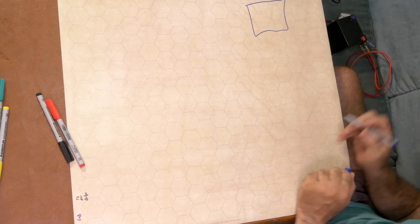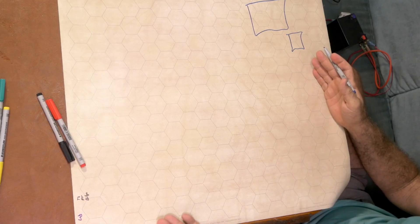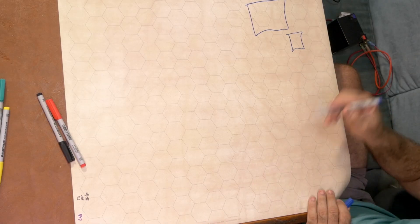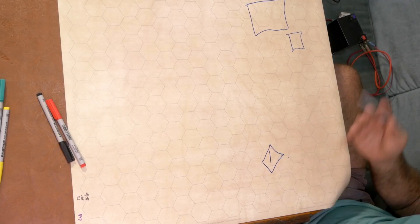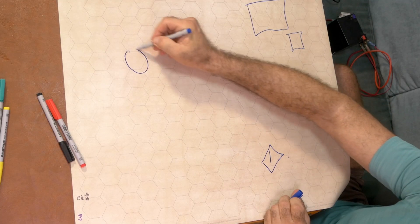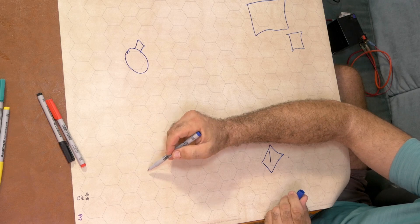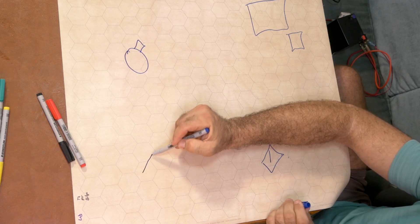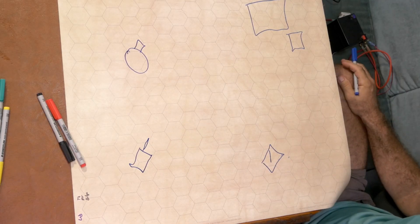What's involved in this circuit? There would be a battery. There would be a circuit breaker, because we always want a way of protecting the rest of the boat from the overpower that can come out of the battery. We talked about current control devices last week, so you can review that if you'd like. We're going to want a switch of some kind that can turn off the bilge pump in case we need to do maintenance. We of course need the pump itself, and it's nice if a bilge pump turns on automatically when there's water. We don't want it running all the time, so another switch that will adjust whether the pump is on or not based on water in the bilge.